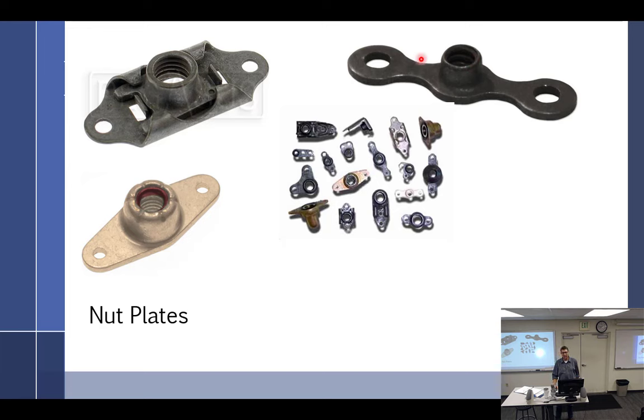We were building the airplane, and we installed a bunch of these to hold the cowling on. I had one side, and the other guy had the other side, and we were using non-structural stainless steel screws to go in here. They're not a good match, because this is really crimped hard, and if you don't do it just right, you end up stripping out the head with your drill gun. I'm just fighting it, and finally I've got my trusty Snap-on ratchet, and I'm really just forcing it.